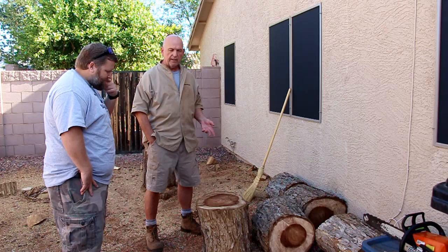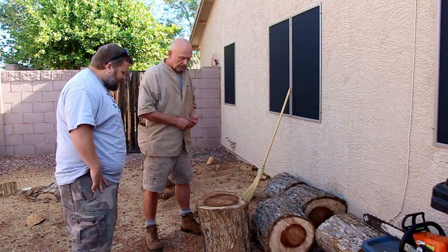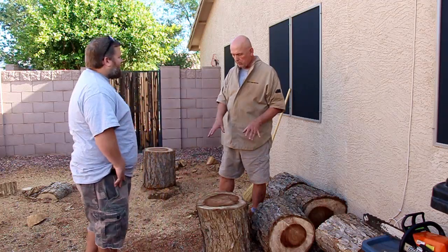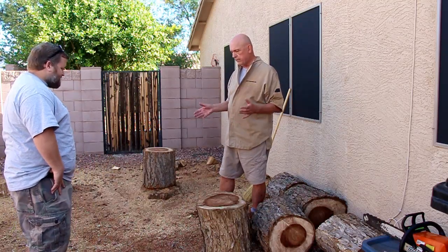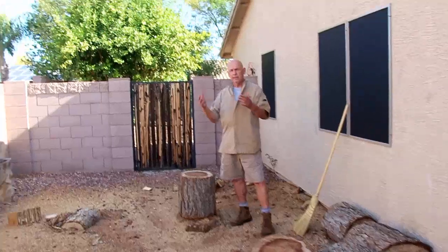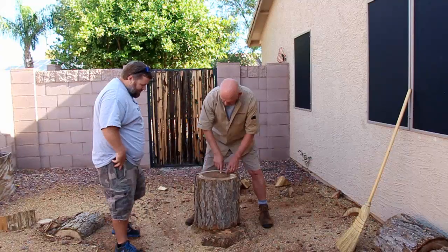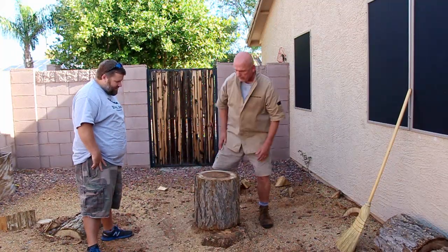This is wet wood — these trees came down about a week ago, so they're still green. The process starts with the log: we have to split it down the middle with a chainsaw, ripping it right down the center. The bowl comes right out of the side, and we'll show you as we cut the log why that's important — it gives great stability to your bowl. Once you cut the log down the middle, you have two halves. The upper flat surface is going to be the rim, and the outside of the log becomes the outside of the bowl or the base.